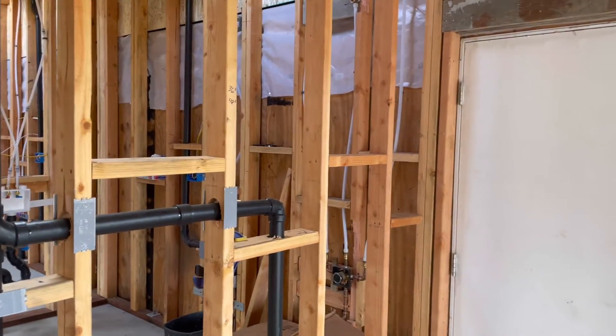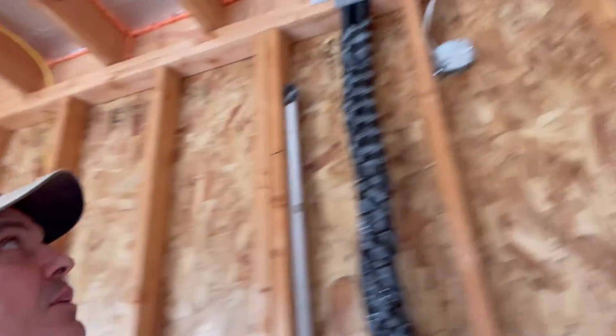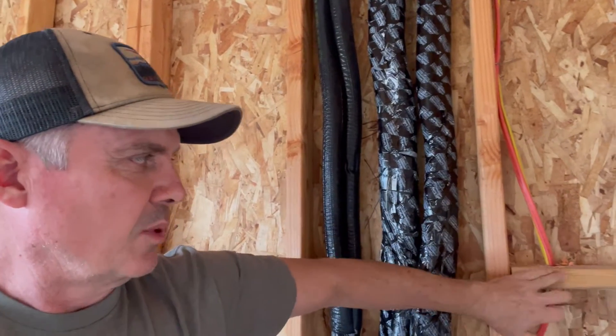At this point I need to go and get everything buttoned up for the rough-in inspections. That means a lot of stuff like this gas line can't just be loose — I need to go around and put up clamps and staples everywhere. Also nail plates anywhere that you have a water line or an electrical conductor that needs to be stapled off, with nail plates anywhere the drywallers could potentially hit.